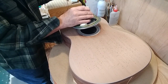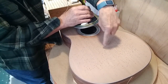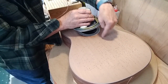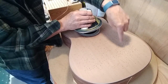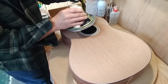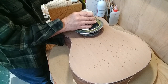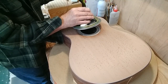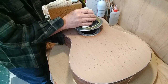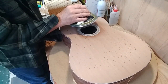Then we just start our sweep, watching the vibration of the pepper on the top. Right now we can see a small amount vibrating — it's not vibrating enough to move it away from that center area — and that is at 13 Hertz. Backing off a little and going up, we've got a little bit larger area at 18 Hertz.